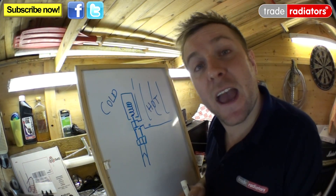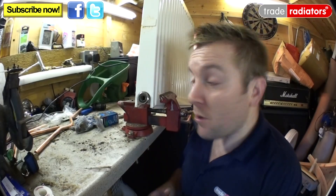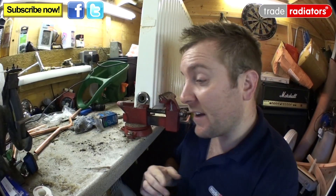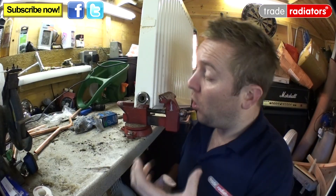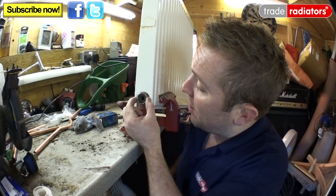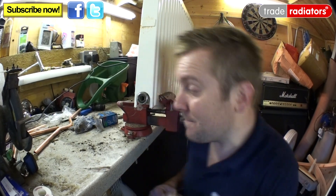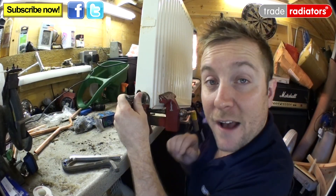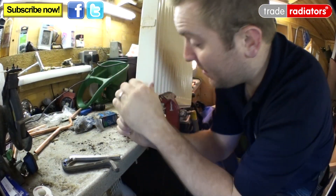Now let's have a look at the different types of thermostatic radiator valves and how you actually install them. We're going to use this old radiator to show you how to install a TRV. Often you'll either be replacing an old faulty one, or taking off an old lock shield to update the efficiency of your heating system. A lot of the time you'll have old imperial radiator inserts that are a bit more difficult to deal with. What you'll need is a special tool — you get inside the hex, not on the outside, and use your tool to actually remove the old insert. Sometimes you'll need a little bit of help from an adjustable spanner.